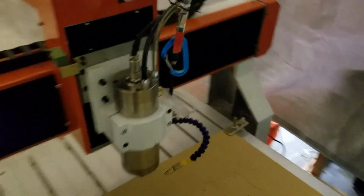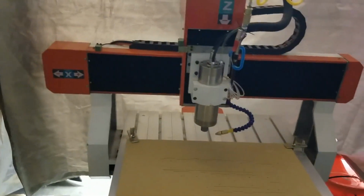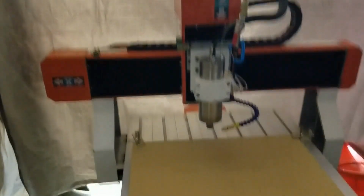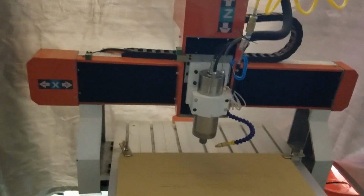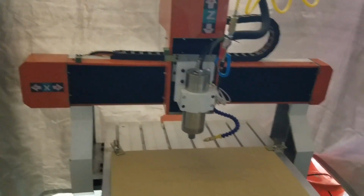And I also found out that the spindle speeds I've only limited to 3 different speeds, not a 0 to 10 volt analog, as these spindles can actually, the VFD can actually accept. So I've decided that I'm going to have 1,000 RPM, 18,000 RPM, and 24,000 RPM. 1,000 RPM for edge finding and that sort of thing, and 18K and 24K for actual cutting. If I need to go lower than 18K or lower than 24K, I can change it on the VFD directly. That's not too hard.